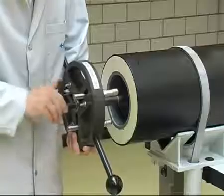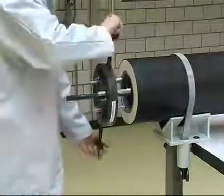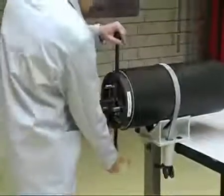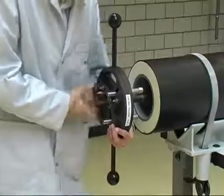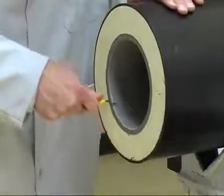Lightly lift the head of the tool to ensure good alignment, then tighten the jaws with the spring handle. The cutting head with the cutting head spindle is now wound evenly using both hands until the cutting head is flush with the end of the pipe. During this process, material is removed from the inside of the pipe. When the correct calibration depth has been reached, the tool is rotated anti-clockwise to remove it from the pipe. The jaws can then be loosened and the tool removed — take care not to scratch the inside of the pipe. After calibration, chamfer the inside of the pipe to an angle of 45 degrees using the deburring tool.